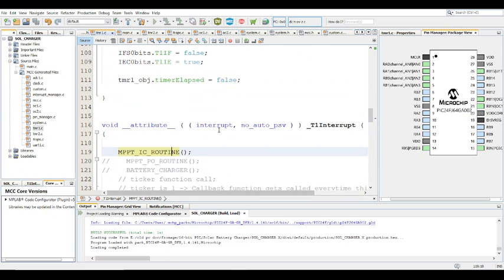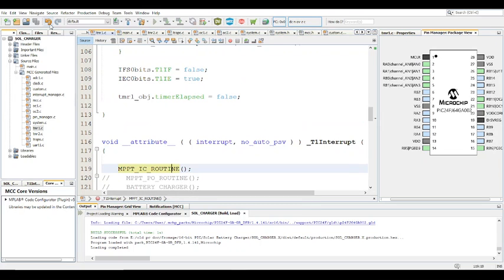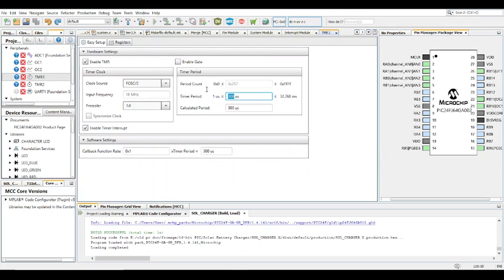Yeah, that's about it. And also, if you notice, the getting to the set point is actually too fast, I think. Usually the physical solar charge controllers you buy don't settle too quickly, so you want to take that into account. Maybe increase the time. This is 300 microseconds, which is kind of extreme, to be honest. You want to increase that, maybe experiment with 1 millisecond, 2 milliseconds, 3 milliseconds, give it some time to actually change. What I'm doing is a bit aggressive, but it is what it is.